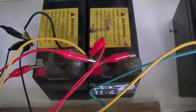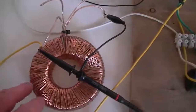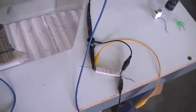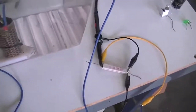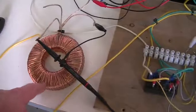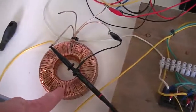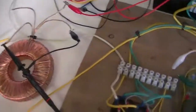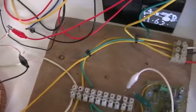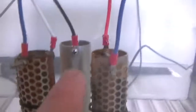From the battery bank, I'm going through this isolation transformer which you would have seen before. I'm just using it so I can hook both of my scope probes up to the system, and I have to isolate them because they share a common ground between the two channels. This has a resistance of about 0.3 ohms — very low — and very thick cable, so there will be very little loss there. We come out of our isolation transformer, go through the block, into this red lead, which is on this cell here.